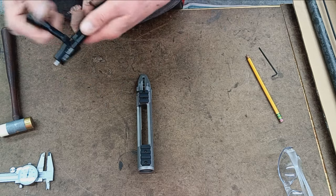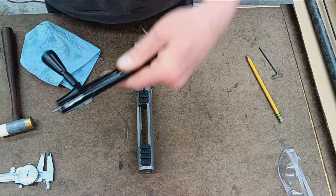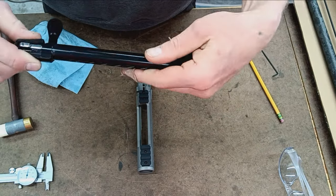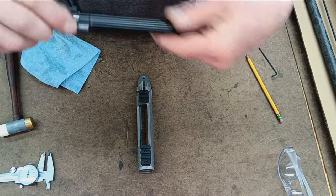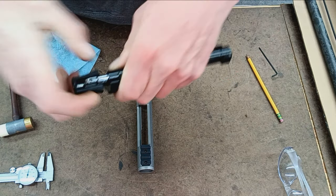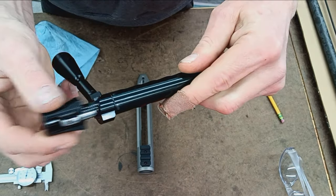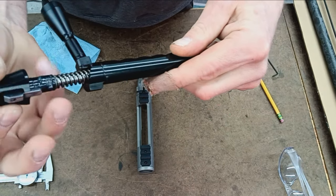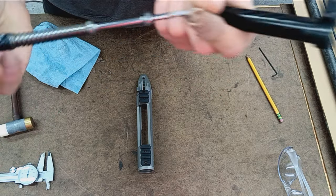Toolless removal of the firing pin assembly. So typically, like a lot of these nowadays, you would unscrew this actually clockwise. See if I can get it. Yeah. So you'd screw that. It comes out of its little notch inside these two little cams. Release, and then the entire thing comes out.